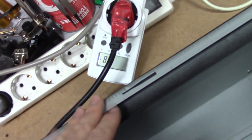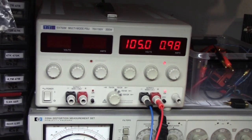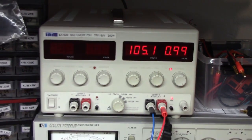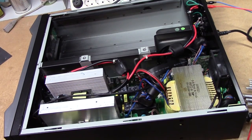We just don't have enough juice in the power supply, so let's get rid of the light — just a single 60 watts. Drawing 120, so beyond the 60 watt idle power, this thing seems to be quite efficient anyway. Let's try it again. Drawing 105 watts exactly for a 60 watt light bulb — that's not too efficient, but I mean it's more efficient than it was. It's also running with the mains at 120, so that's something I suppose.